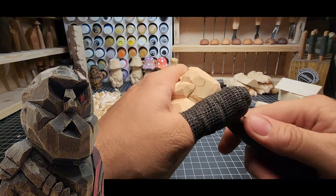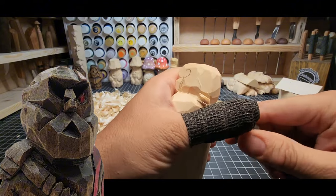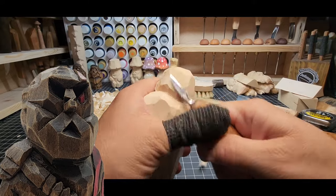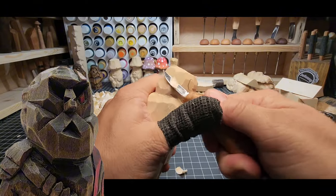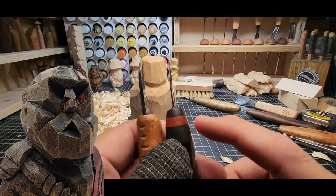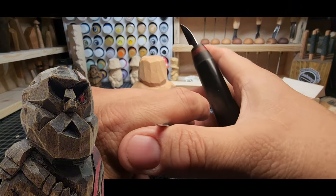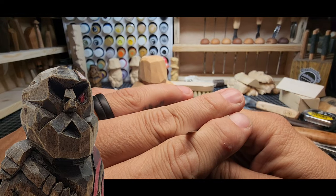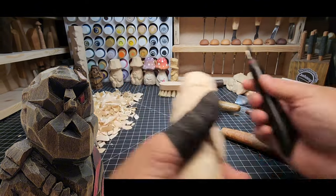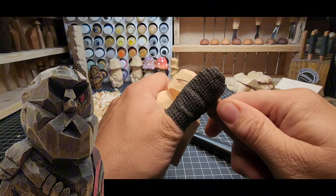So I can get this little v-cut here behind the beard quite easily. I'll use it to provide a little depth there on the neck, just bring that along the edge. It's real deep and real easy because it's so thin. I'll take that chunk out — stop cut the bottom to chip it out and bring that neck in along the shoulder. I have two detail knives I use most often — this one with a really thin blade, and a more thickly-bladed one. This other one lends itself more easily to slicing off chunks. The thicker one is much more v-shaped through the spine, while the other is very thin, so for fine details I use one and for getting out larger chunks in smaller areas I use the other.